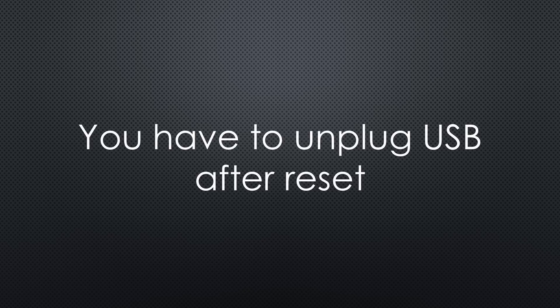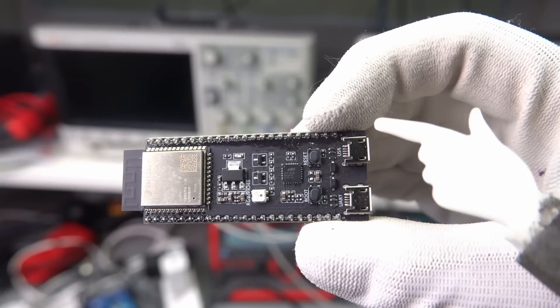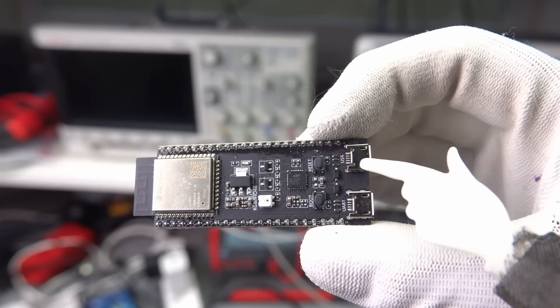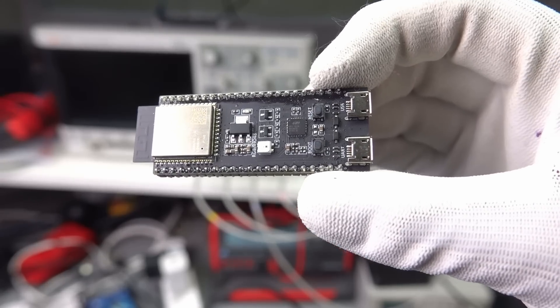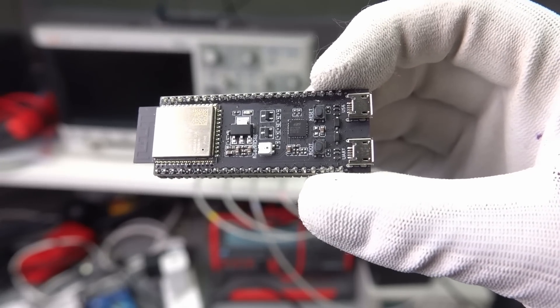You have to be aware that in this mode the COM port changes after the upload. After resetting the ESP, I regularly had to reconnect the USB connector — not too convenient. This is probably why many development boards still offer a standard USB connector using a USB-to-serial chip parallel to the native USB interface.